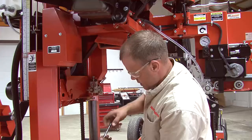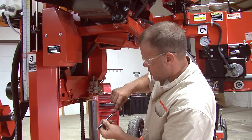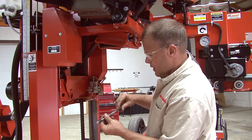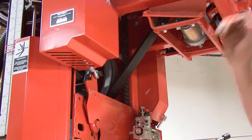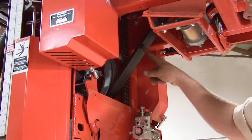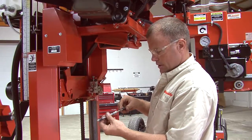Bring it down here. Right there it's telling me it took 18 pounds to push that 7/16 of an inch. That's actually what you're shooting for. With this mill, with the diesel engine on it, 7/16 deflection, 18 pounds of force.